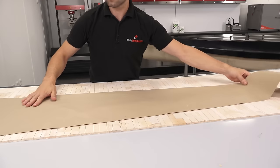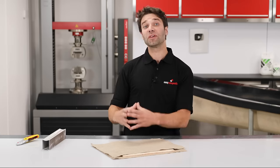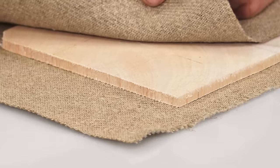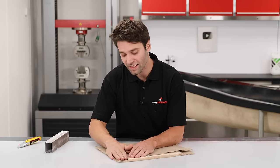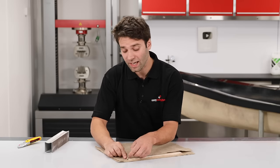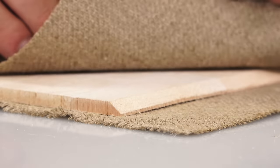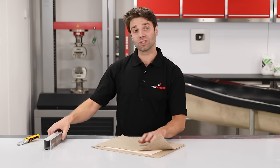Any conventional cutting methods will work with balsa. For this project I'm simply cutting around templates using a knife. Whenever working with solid core materials like foam or balsa it's really important to finish the edge of the core properly. Leaving a straight 90-degree cut can lead to bridging problems — subsequent layers of reinforcement and the vacuum bag will struggle to follow contours fully, leaving a slight cavity around the edge of the core. That cavity fills with resin, causing print-through on the surface, and in resin infusion it creates a fast-flowing pathway that can disrupt resin flow and potentially cause dry spots. The solution is straightforward: put a chamfer on the edge of the core so subsequent layers follow perfectly. This is done easily with a simple sanding block.